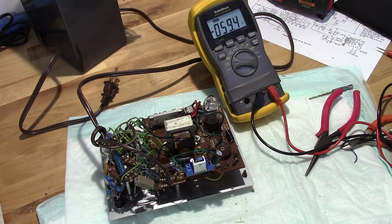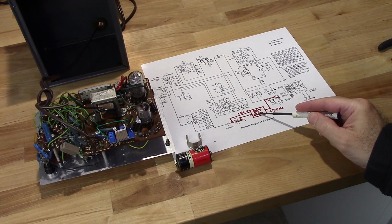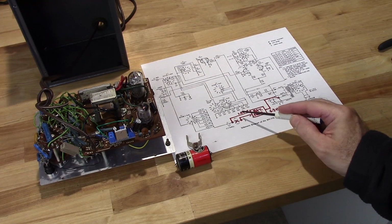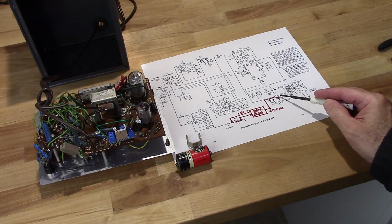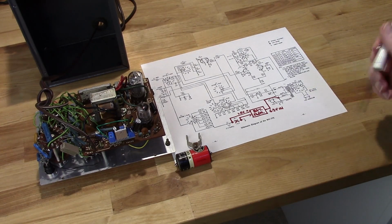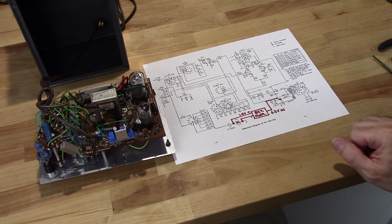My battery is no longer an issue. So here's exactly what I did. I went ahead and put in this battery eliminator, got rid of the battery, tied the plus 1.5 volts here, the minus here. I'm getting the 6.3 volts input off of pin 4 of the 6AL5, and as you can see, it works great. So no more batteries, and no more worries about corrosion.